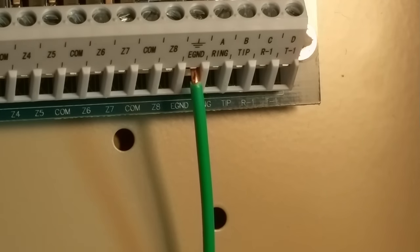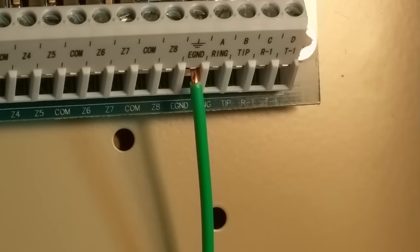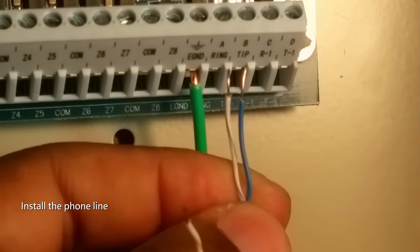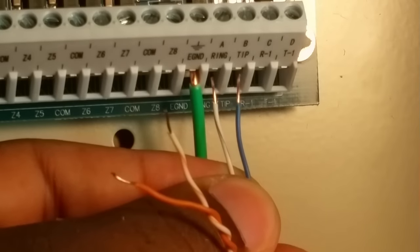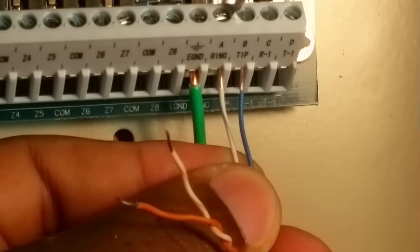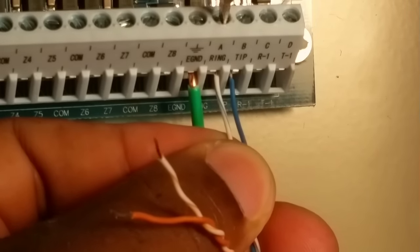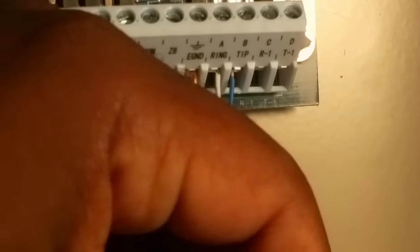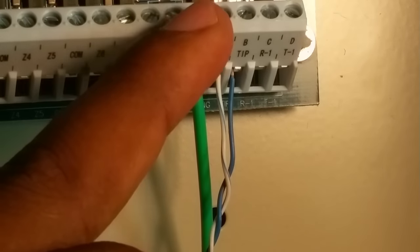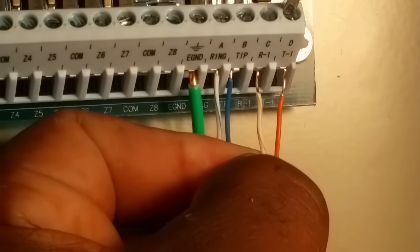In a normal installation you'll definitely want to have your RJ-31X, which probably comes with your kit depending on which kit you pick up from DSC. I'm just going to show you how to wire it — think of it as the wire coming from your phone service, whether it's AT&T or Comcast. Plug it in right here; this is your incoming line from the street. This is your service out, meaning from the alarm panel to the main house. The alarm panel always gets the phone line first, so if someone is on the phone and the alarm panel needs to call out, the alarm panel takes priority of the phone line.